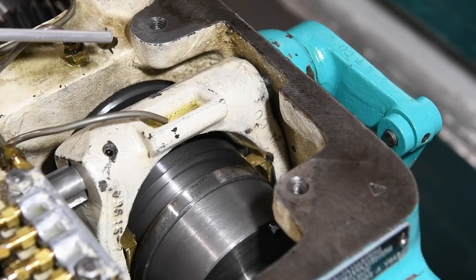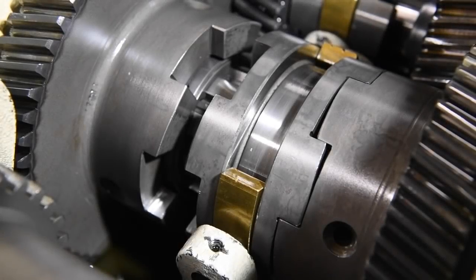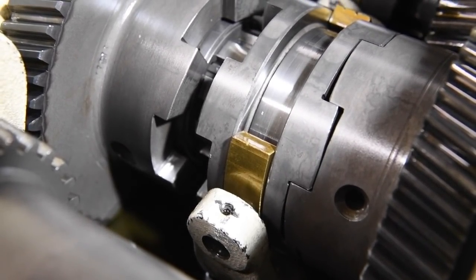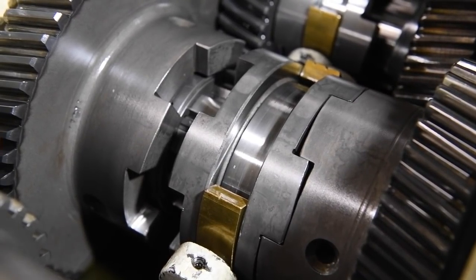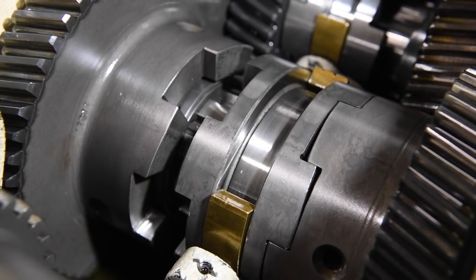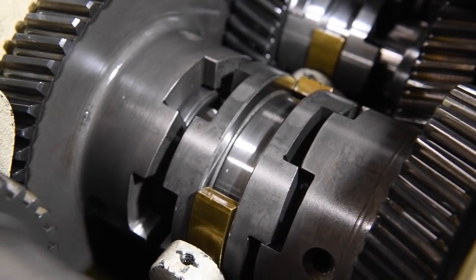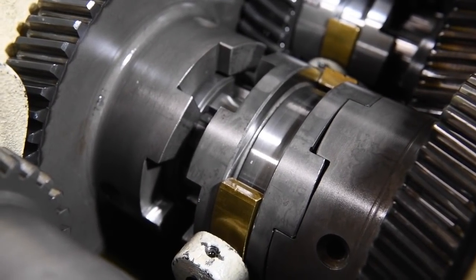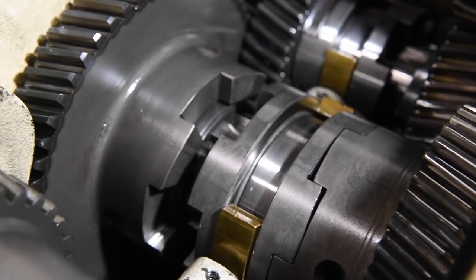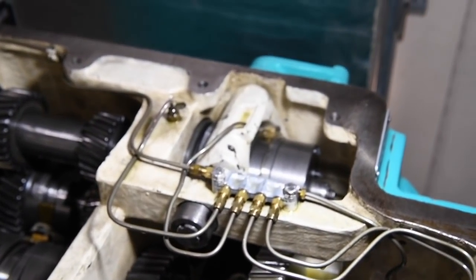Hopefully by having the shaft adjusted without all that slop and getting oil on those parts, new shoes would solve the problem. Here on the middle shaft, these shoes look to be in very good shape. This yoke is upside down compared to the other one, but it does the exact same thing — the brass shoes just fit in that groove. The speed-changing lever on the front of the headstock is what I'm moving side to side right now, and those shoes are just pulling that dog one way or the other. It's pretty obvious how worn out the other ones are — the ones causing me problems.